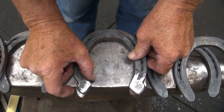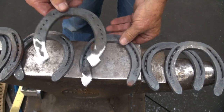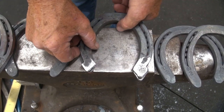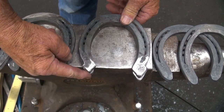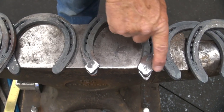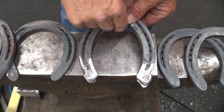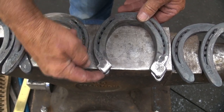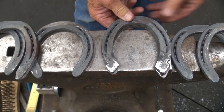This material is moved to the outside and packed back in instead of stretching it out. Lay it on like this, you can really see what I'm talking about. This is the double, but it's still the same length as the shoe right out of the box. This is the medial side, or medial extension. This is the lateral extension, which is not as far as a trailer. The lateral and medial extension should project laterally or medially, not posteriorly out the back. So that's the hind shoe with trailers and extensions.